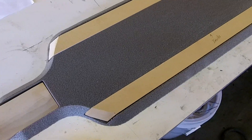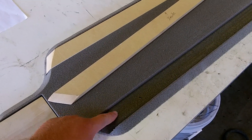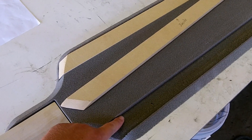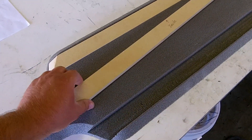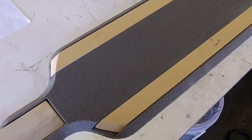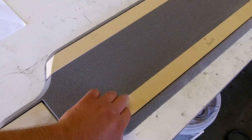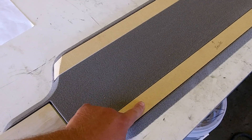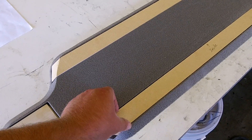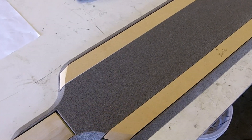The reason why I'm doing this is because when you lay the carbon fiber in some of these channels, it has a really hard time when the vacuum bag pulls down to get tight into that corner. So what this board will do is suck down so that it gets a nice corner along the edge of the carbon fiber. I made this about three millimeters smaller than it needs to be so that it gives room for the carbon fiber inside the channel. Also, it's just a tad lower than the foam core.